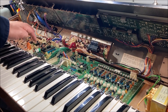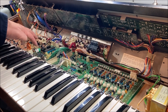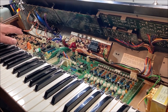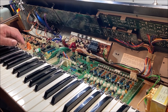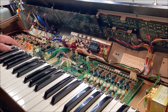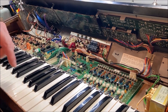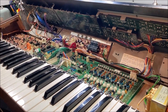This is infamous. Korg put in a NiCad rechargeable battery for the RAM, and those are notorious for leaking. This one did leak and someone repaired it by replacing it with a lithium battery and replacing the capacitor with a diode. It's no longer rechargeable of course. It looked like they repaired a few traces. But I suspect that this is the board that is creating our short, and we can confirm that.